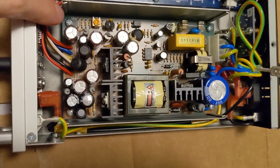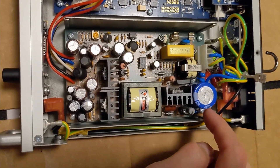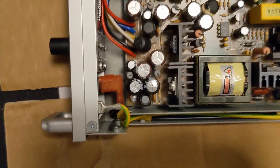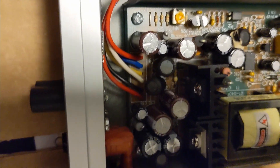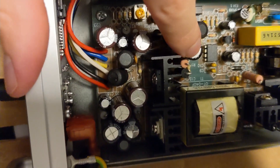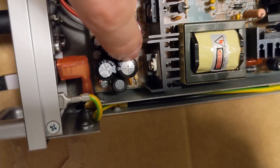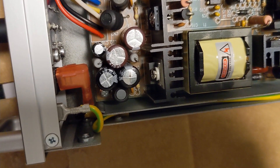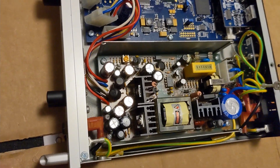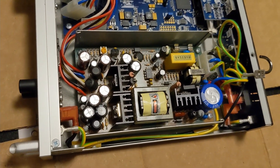There are four more screws to take this board out. Now I want to point something out — when capacitors go bad, they usually pop. So if you look at the tops of all these capacitors, this one looks nice and flat, these all look flat. But look at this one right here — that one's bulging. This is probably what the problem is, that capacitor right there. But because this is over 10 years old, I'm just going to change all the capacitors out at the same time, because inevitably they're going to go bad again.